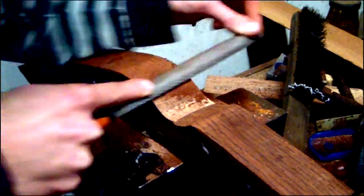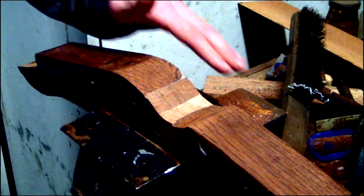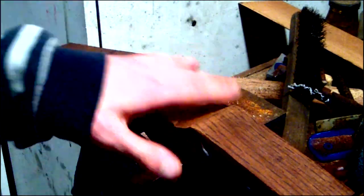One final note: when you clamp the timber you will have glue oozing out everywhere. I recommend wiping off the excess because it is easier to do it now rather than when it is rock solid.